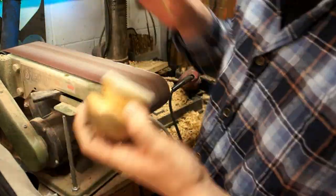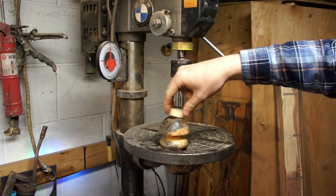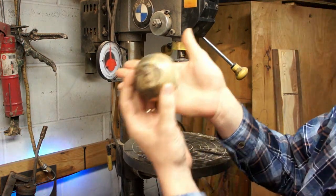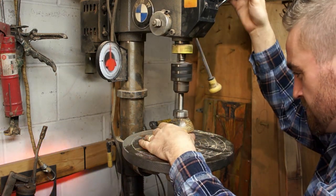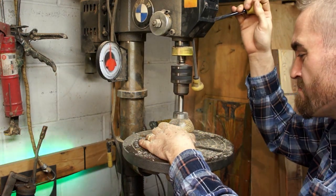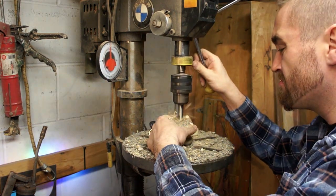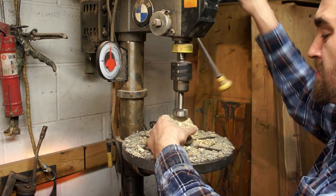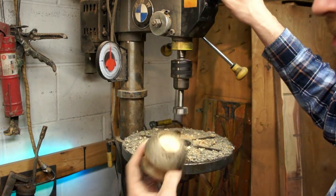At this point I didn't really know what I was making it into, but I figured why not stick a candle in the top of it. The rounded top obviously didn't work too well, so I had to use a Forstner bit to create a cavity in there. It's usually kind of a problem drilling that on a dome, but because the tail stock had pushed that center into there it gave me a reference of exactly where to drill, and it kept the Forstner bit right on the right path — like a pilot hole built in.